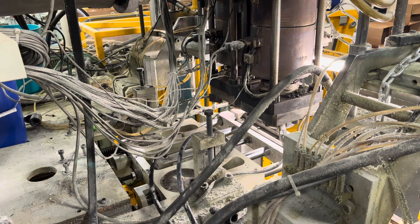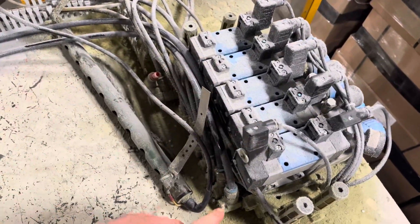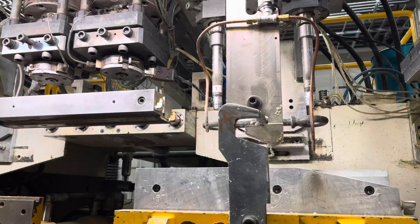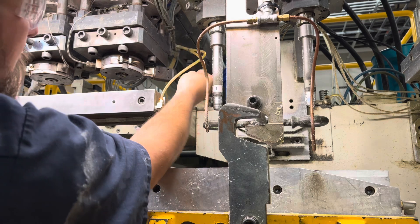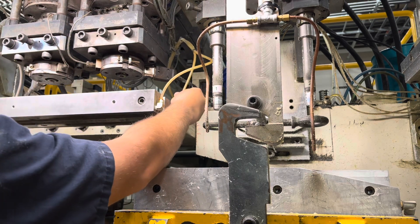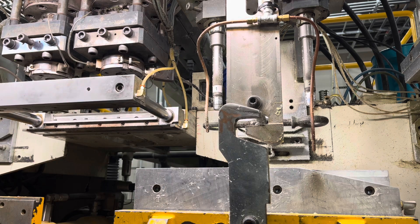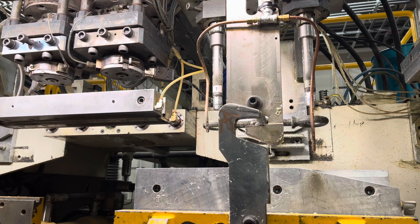I'm sorry, this is difficult not to have my fat head in the way — we're limited on real estate up here. These are the lines coming from the valve of the machine that will run that cylinder just like we did in the shop. They come from this valve stack over here where we can control the velocity, and these solenoids run everything from the controller. The only thing left as far as hookup is concerned, we hook up our cooling water to these — because this knife is chilled, that's why it's called a cold knife. So whenever this thing is in operation, these aluminum bars will be cooled by chilled water, and that prevents the plastic from sticking while it's working. Really nifty design.